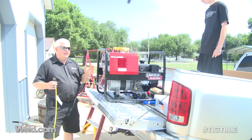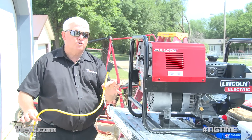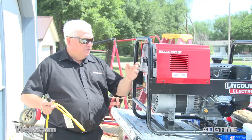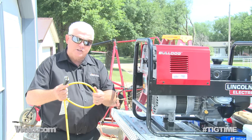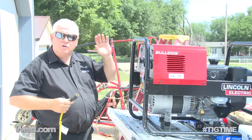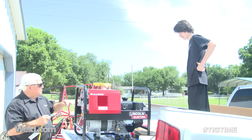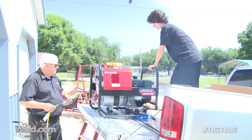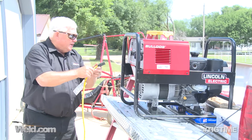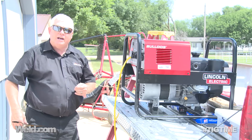I decided to test this even further. I didn't just put the welding machine next to the generator and plug it in. I'm going to see if my RV extension cord will work. This is a hundred-foot extension cord. The Bulldog instructions are probably going to say don't use a hundred-foot extension cord, but this is heavy duty and our machine's inside the shop here, a hundred feet away. So I'm going to have Seth start this, plug it in, then we'll go in and see if the MT125 works. We've got the Bulldog 5500 running. I'm going to plug it into the 115 — this looks like a 20-amp circuit. I'll join you inside and we'll see what it'll do.